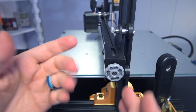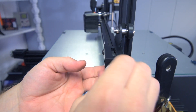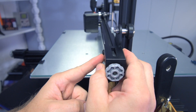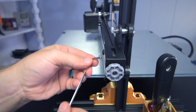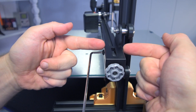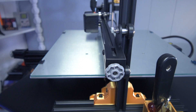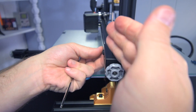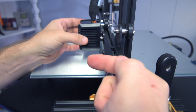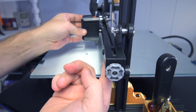Let me show you what's happening here. This tensioner is actually skewed to this side. And if I go ahead and take some pressure off of it, you can tell that there is some play here, and the play is all on this bolt right here. What's happening is if you try to tighten this bolt to hold it in place, you can't tighten it any further because it's actually butting up against the bolt on this side, so it has nowhere to go. You can actually strip this side if you try too hard. Under tension, this tensioner is moving off to the side, and through this hole here, the belt is moving all the way to this side, causing it to rub up against the extrusion here, causing all kinds of skips and grinds.